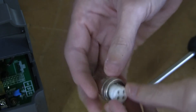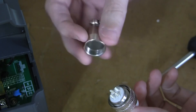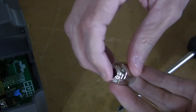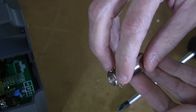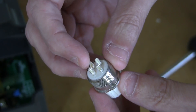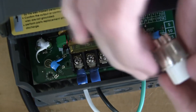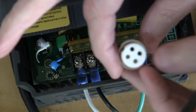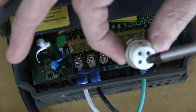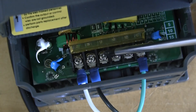The spindle will come with a connector for the back of the spindle, and it is the female part of the connector. To separate the connector and get to the insides, you just screw this off. Make sure to put this back before you put this section back on. At the back there is a strain relief — when you put the cable in here, you'll screw down these two screws and it'll provide locking for the cable so it can't be pulled out easily. The posts on this connector are little cups that you'll need to use for soldering. The U-terminal is wired to the number three terminal on the connector, which is located opposite the little notch on the side. Number one pin is for V, and number two pin is connected to the W-terminal.